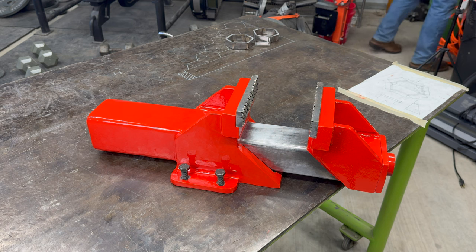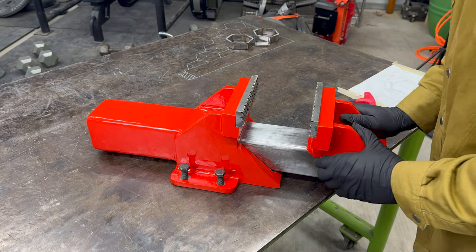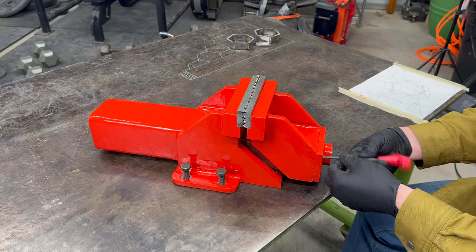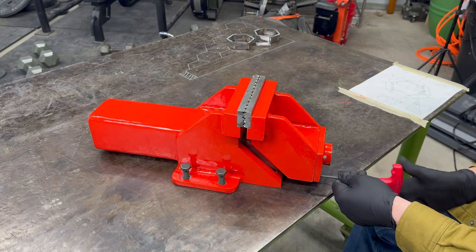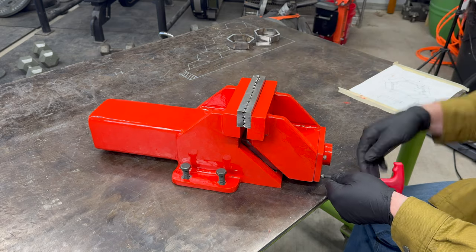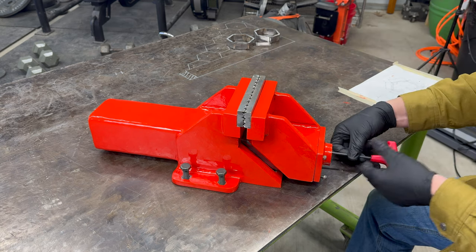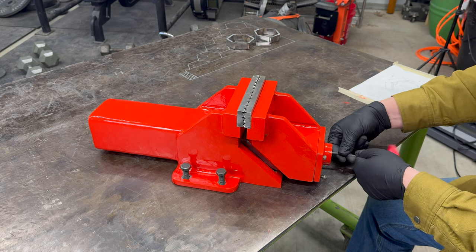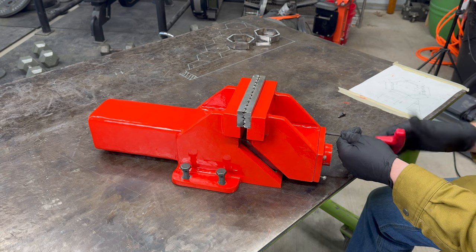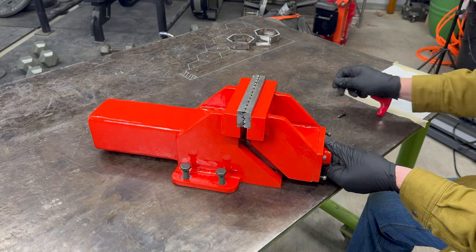Let's get to it. To take this off we're using a 3/16ths Allen key. I did quarter-20 bolts on all four corners of this front plate. It's really only needed for when you're opening the jaw — if you try to hold something, the force gets transmitted through those cap screws. But during the actual gripping or pinching action the vice is mainly used for, all the loads are going to go through the plate into the square tubing or the sidewall half-inch plates. This setup allows for easy access to the thrust bearings on the inside of the vice.